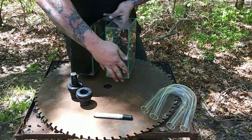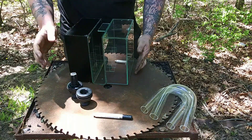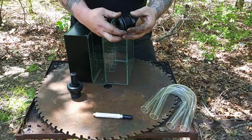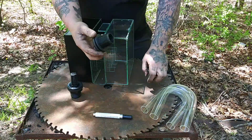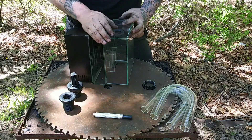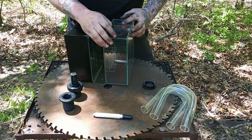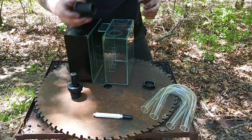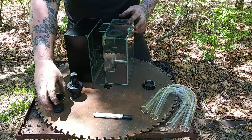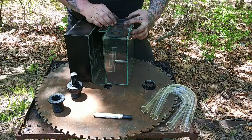Overlook the glue marks — I've still got to sand and clean that up to make it look decent. Had a problem with the actual glue not wanting to work right. So what we're going to do is take these bulkheads and place those two rubber o-rings on the overflow box where I want these to go. At the same time, you have to make sure the o-rings line up with the outside of your bulkheads — you don't want to get it too close to the edge. Line it up so you can drill your holes.